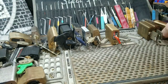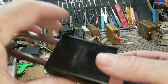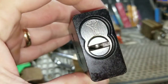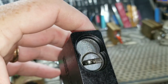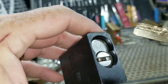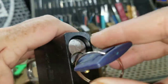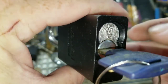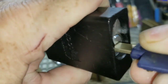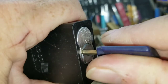Then there are these two with different formats. This is an American Lock 1405 — the long shackle — and I've got a Multilock large format interchangeable core in a Yale profile. It works the lock up beautifully. It's a little short for the lock, set up for the sixth-seventh pinner, but I've got this one keyed specially so this side opens the lock and the other side works it in control mode. Pretty awesome.